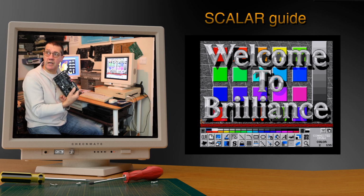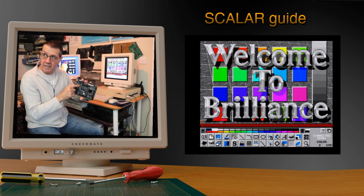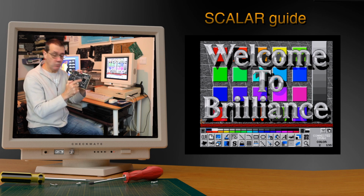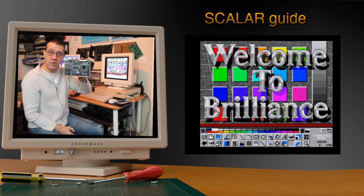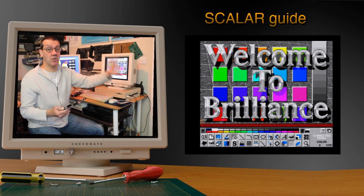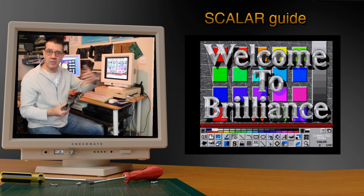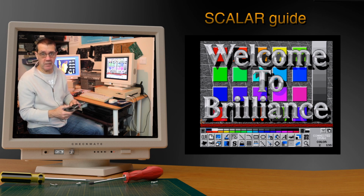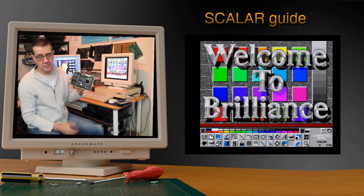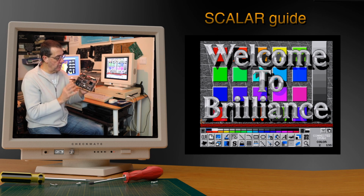And this has a load of circuitry, so basically this little chip here converts to CGA and EGA, okay, so you don't really have to worry about that, but it all goes into this big chip, which is the main chip, which is the TrueView. And what that does is it upscales it. It converts 15 kilohertz up to 31 kilohertz so that it will work over VGA. I'm not going to give you an explanation of VGA. You need to look that up separately. But it then allows it, because VGA works as standard as 31 kilohertz. So this is why it's called an upscaler. And what it will do is it will then output to the panel.